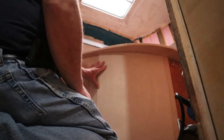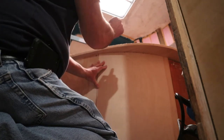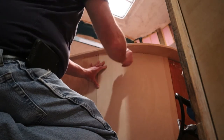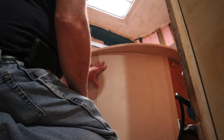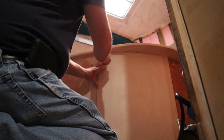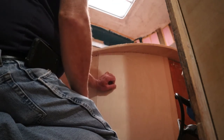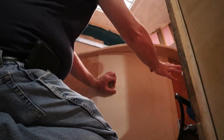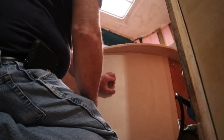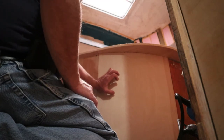And there we go - that's pretty much perfect. So now what I'm going to do is pre-drill a bunch of holes between where the kerf cuts are, and then go ahead and secure it with some screws. That's that done. The plan is - and it's always changing - but I believe the plan is to cover this with a thin layer of finished plywood, something with a nice grain to it, yet to be decided. I'm pretty happy with that. Doesn't look bad at all.